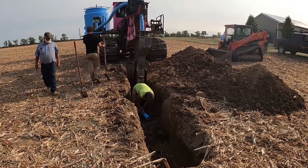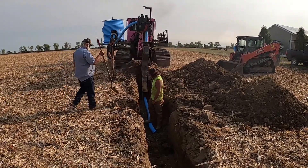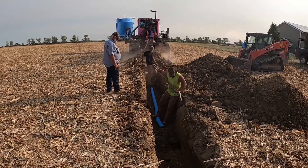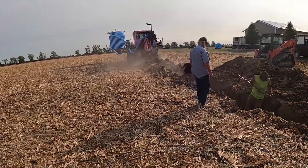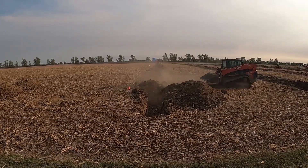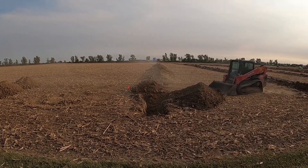You can see the next step after they find it: when the plow comes back from his previous run, a couple of guys there will get that four-inch lateral tied in with the sub-main. They'll stand on the pipe and get a couple of shovelfuls of dirt on top of the lateral to hold it in place while the plow takes off. Once there's enough soil from the plow disturbance on top of it, they're no longer needed, and they'll come in and fill in that starter hole. That's what the skid steer is sitting there for.